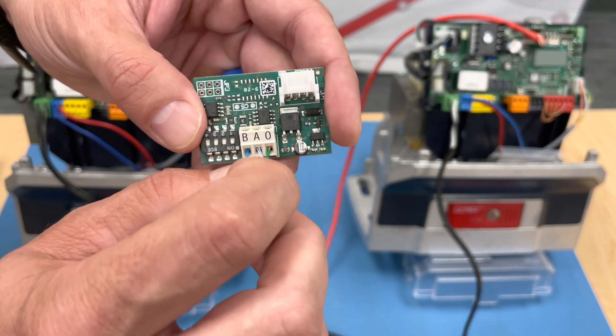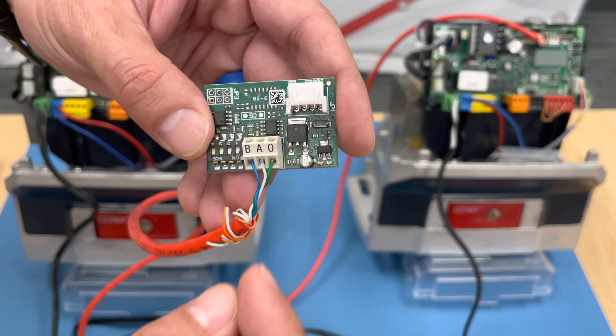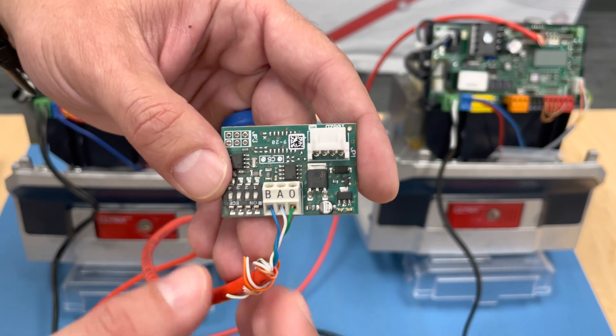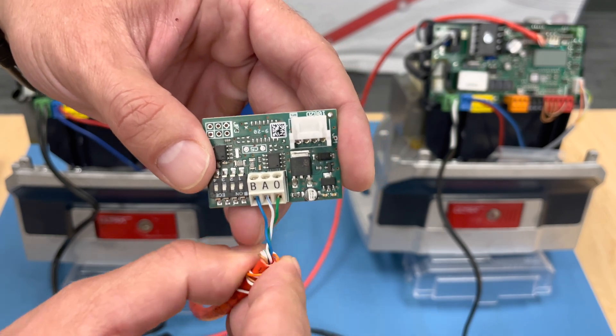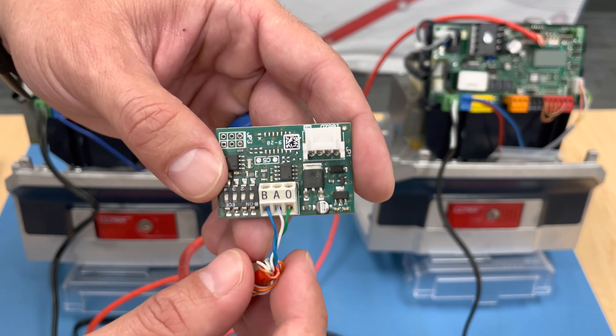So let's say I chose a pair of blue and blue-white — I went to B and A — and then I chose green by itself and went to zero. It doesn't have to be those colors exactly, but follow my logic on this and how you did it to make sure you get the least amount of interference. That's the whole purpose of them being a twisted pair.